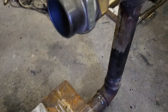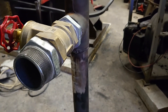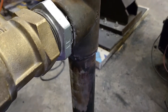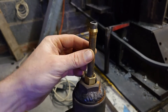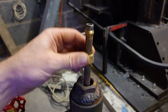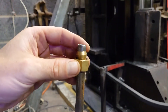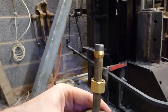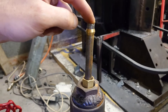You've got two-inch bore pipe into an elbow and gate valve. Then there's a section made from half-inch or 12mm steel pipe instead of copper, welded in, because bulkhead fittings that fit through stuff are difficult to find. It has a normal olive fitting on the jet piece. In the end of the pipe we plugged it with weld, then drilled and tapped it to suit an M6 MIG welding torch tip.